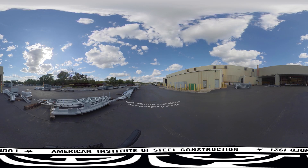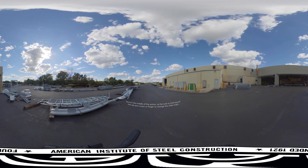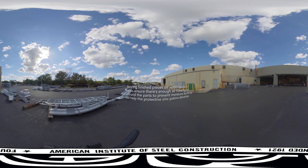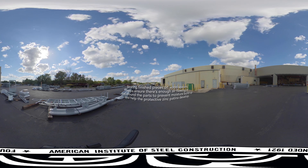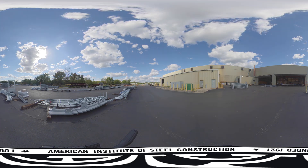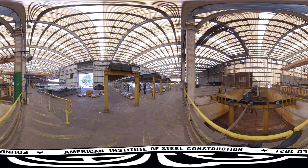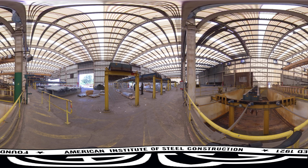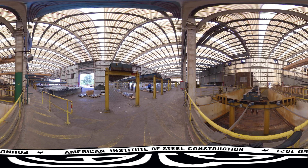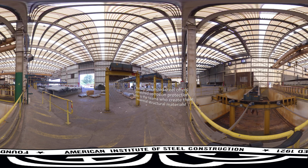The galvanized steel is ready to go, but the job site or fabrication shop may not be ready for delivery quite yet. Galvanizers stack hot dip galvanized steel at an angle with wood spacers to ensure there's enough air flowing around the parts to prevent moisture buildup and help the protective zinc patina develop. Without adequate airflow, the steel can develop a white powdery finish called wet storage stain. These wood spacers sometimes travel with the steel all the way to its final destination, and forklift operators load the steel onto trucks for its journey.